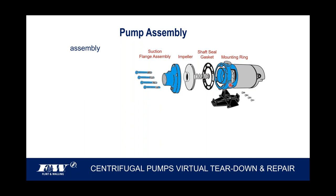And the reason behind that is pretty much on your screen right now. There's not a lot to these centrifugal pumps. They are a pump. We do manufacture these. Now, what you're looking at on the screen is what would be called a single stage centrifugal pump, meaning there's just one impeller. And most all the self-priming pumps, most all the jet pumps, this is exactly the configuration you'll see in the form of a single impeller.